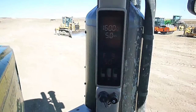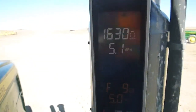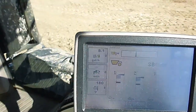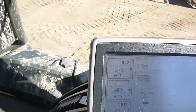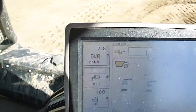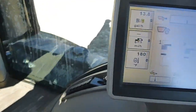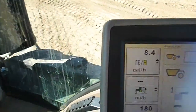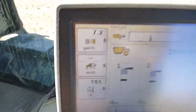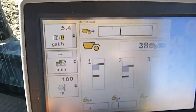I'll hit this, it'll automatically start up-shifting, our engine RPMs will come down. At 1630 RPM, since we're still going uphill, we're not seeing a huge difference in fuel, but we dropped a couple gallon an hour there — down to about seven. And they say that this fuel efficiency system has shown savings of up to 30% in fuel consumption over the course of a day.